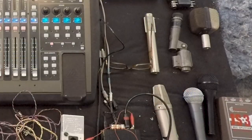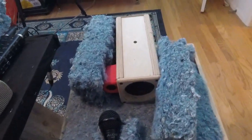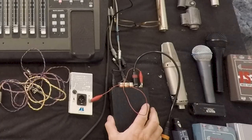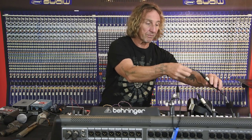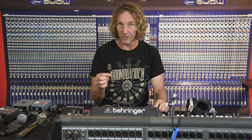What we'll do through the next video or series of videos is test several different microphones. I've got a test setup over here, with some cotton insulation piled up over a two-way speaker that's driven off this little amplifier. The speaker outputs whatever signal I send to it, and I put a microphone on that. The output of that microphone shows up at this Y cable here. One side of the Y cable goes into channel 1 of the console, and the other side is here, where we'll plug in various transformers. Then this goes to channel 2 of the console.